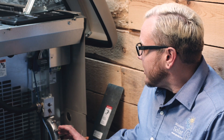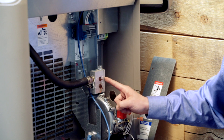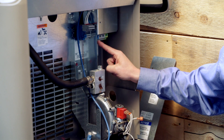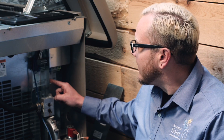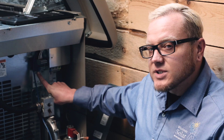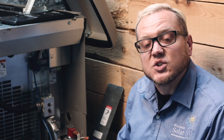I want to give you a quick tour of the inside of the generator where we make our terminations. This is the side of the generator — we've got our fuel regulator, this is our fuel solenoid, and here we've got where we switch between natural gas and propane; this one's already set for propane. Up here we've got our AC output — this is leg one, leg two, neutral and ground that runs over to the inverter input. And over here I want to point out the remote start/stop that I mentioned, labeled three and four. These terminals here are what run over to pins five and six on the AGS — that's the two-wire start.